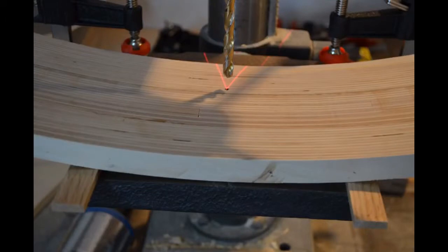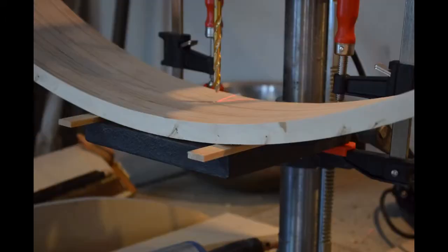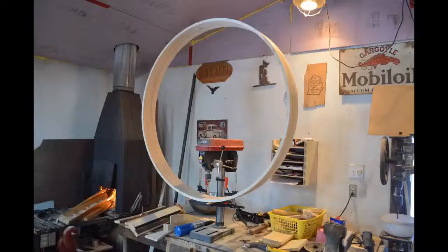After the ramps were in place, we needed to mark out where the wheels would go on the ring, so we propped it up just temporarily and marked it out. Drilling these turned out to be fairly easy because the ring is so large that it will simply sit around the drill press, so we propped it up on there and drilled them.